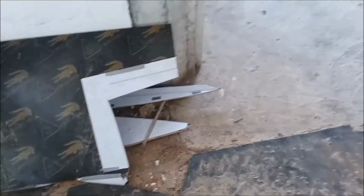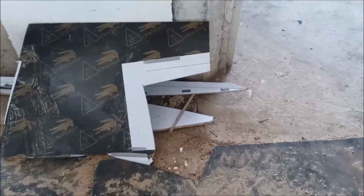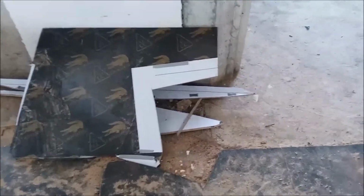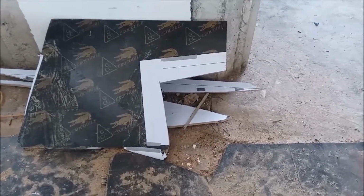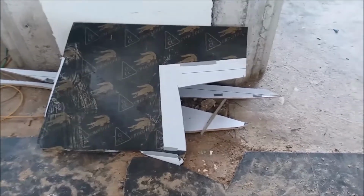Anyway, once you get your one side glued down, you untape all this, of course, and what they call booking wallpaper, you take it and you just fold it back over on the part that's glued down, and it'll stay right there. You can put a weight on it, but you don't generally have to.